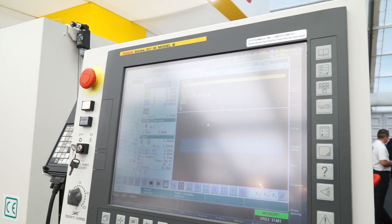And what about the control of it — is it controlled via the control? It is. The whole unit is an independent unit, it's got its own generator. We link it through our ethernet connection and it's just simple M code. So for instance, M51 A 20mm will give you a burn depth of 20mm.